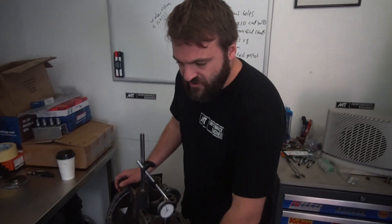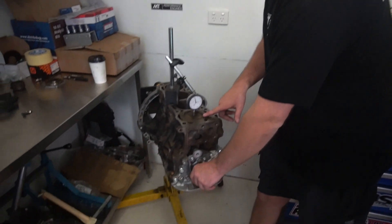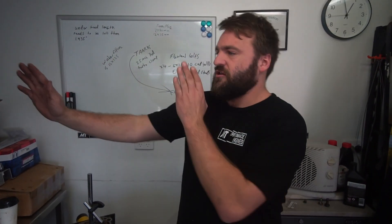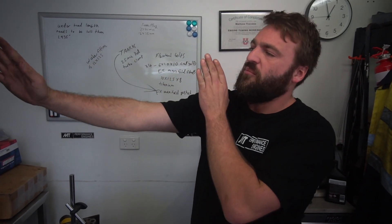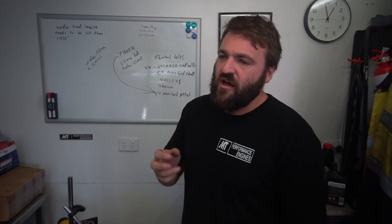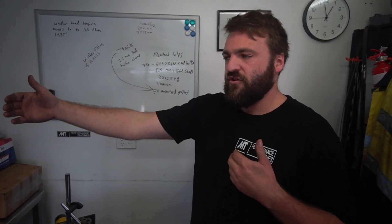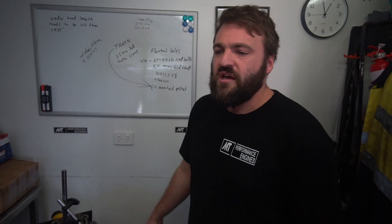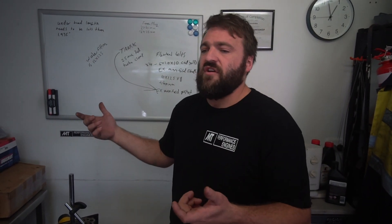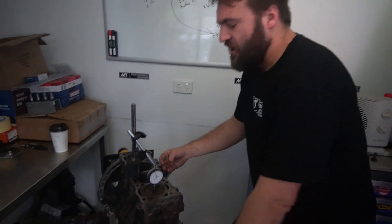It's the same for bearings. And this relates back to our crankshaft indexing. When you grind a crankshaft, you'll find that the indexing of the crankshaft might not be exactly correct — meaning number one pin and number four pin might be slightly out. Might be one degree, might be two, could be worse. Some Toyota diesel engines are up to 10 degrees out, and this is a massive problem over time where they start damaging the engines.